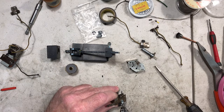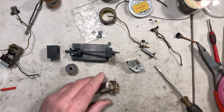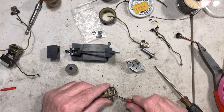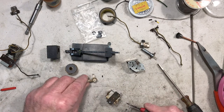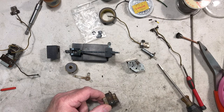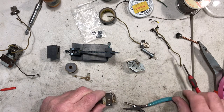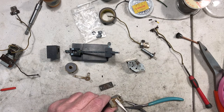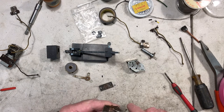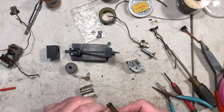That's pretty close. You don't have to go all the way through — you just want to take the surface off on this side. We should be able to pry this off. Not too difficult. You can see we have a little washer there. Pop this back through, get my little needle nose, pull that out of there. I think we can reuse this. I'm going to clean it up a little bit by heating up my solder gun, get this solder cleaned off, and brush it a little bit cleaner.